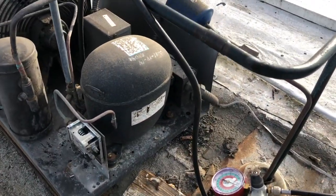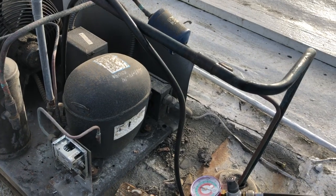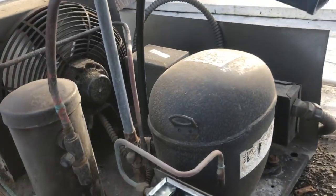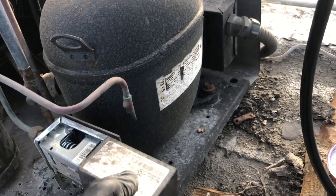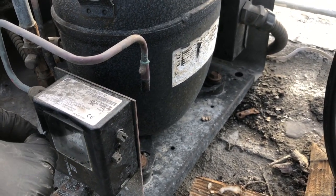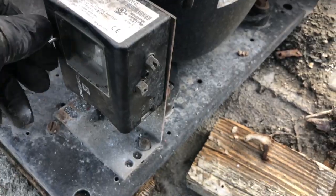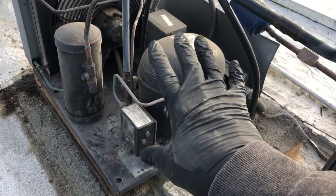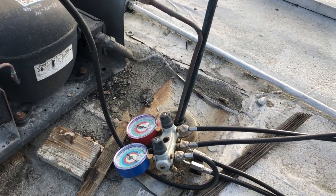It's going to be like this for a while. When we reinstall the evaporator, you're going to change your liquid line dryer — basic refrigeration practices. We're going to get this cover back on. These are always a pain in the ass. We'll get our screw back in there. Alright, so we got the caps back on, the cover back on. We're pumped down, we're sealed up. We'll go down to our evaporator and take it apart.